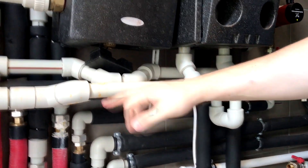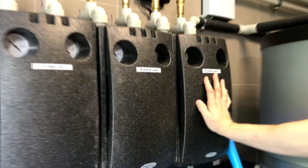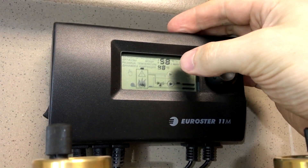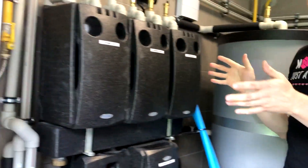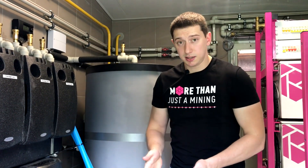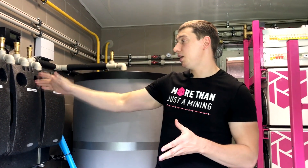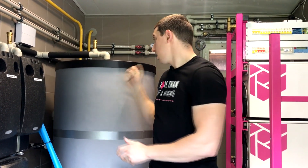Through pipes coming from the group, we can see they are connected to the spiral of the boiler. The pump group for radiators is responsible for heating the outbuildings. It works separately from the boiler automation using third-party automation located a little higher on the wall. Here we can see the temperature in the heating circuit — it's 58 degrees. The entire heating system is controlled by boiler automation, which regulates the heat supply system. Heating level is regulated by outside temperature and domestic hot water, upon the request of the boiler temperature sensor.